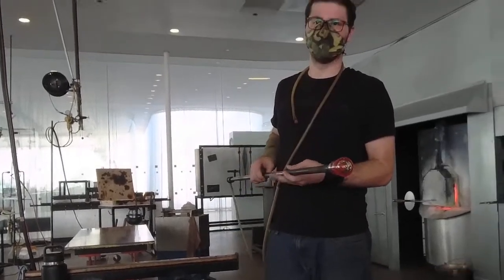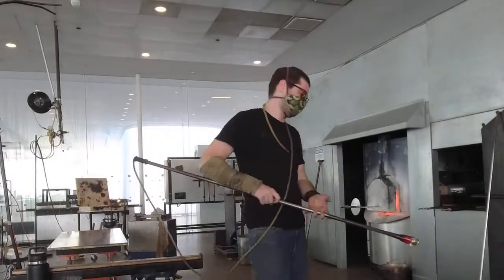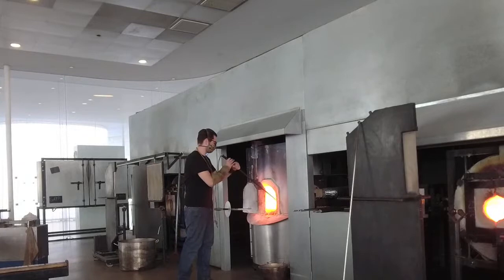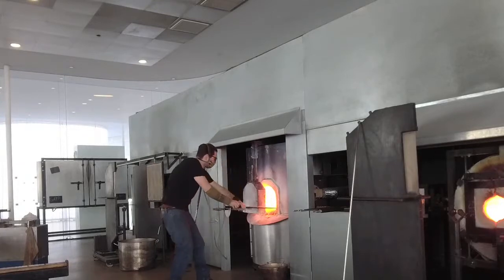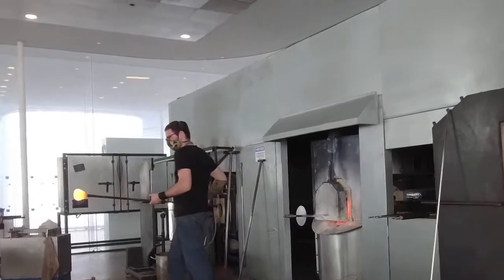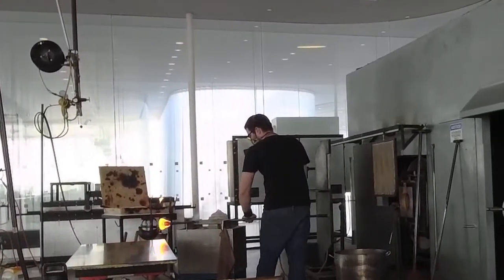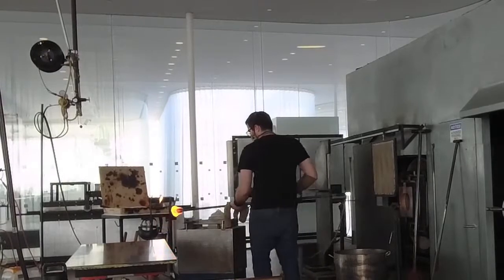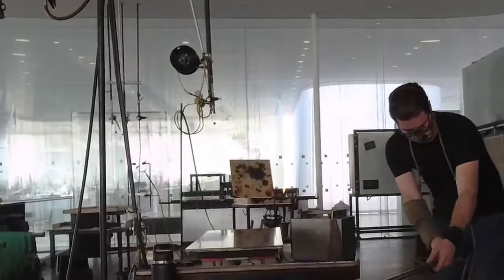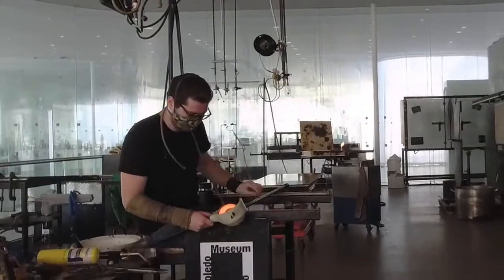There's our nice bubble. The best part about clear glass is that you can physically see the interior. So normally when we do the demos, we make something out of color. Misha sort of guesses based on experience how much wall thickness he has. But in here, with the clear glass, he really has a lot of control, which is really great for George because normally neon tubing comes in one sort of thickness. But in here, we can start to create thicker and thicker tubing, and that'll allow us to have different optical effects. Because the glass sort of, by nature, with thickness, distorts light. And neon is pure light. So this will give George a lot more opportunity to find interesting components within the glass.